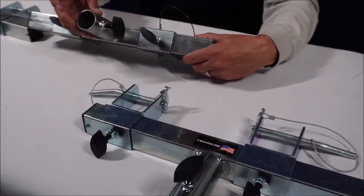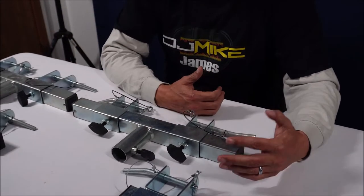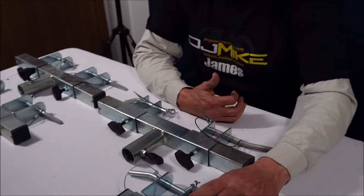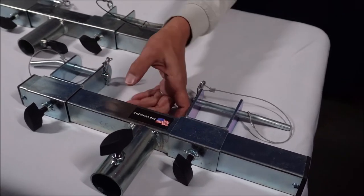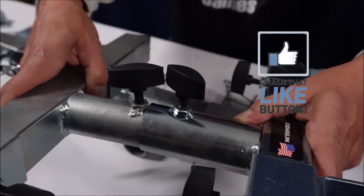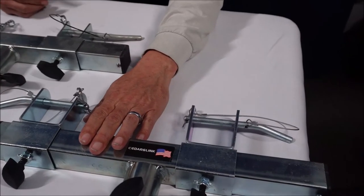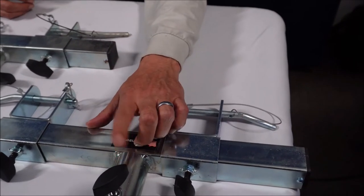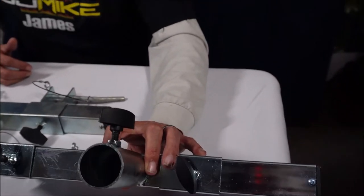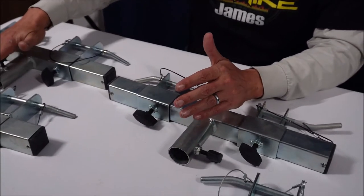This is a Cedars Link Universal T-Adapter. These are all inch and a quarter mount sleeves on most of our crank stands. If you're flying bigger truss, you'd have two-inch stands and two-inch pipe. But this one is actually an inch and a half, so it's larger. I'm going to show you that with the Pro-X Truss T-Adapters — these actually fit inside there — so on a standard crank stand, this is going to be super loose. Cedars Link makes this one in two inch, and it's super good quality. I really like their U-brackets, tie-downs, and the way it's designed. But it's interesting that they made their mounting sleeve an inch and a half, whereas the standards on the other T-Adapters are inch and a quarter, and they fit nice and snug on my ASC crank stands.